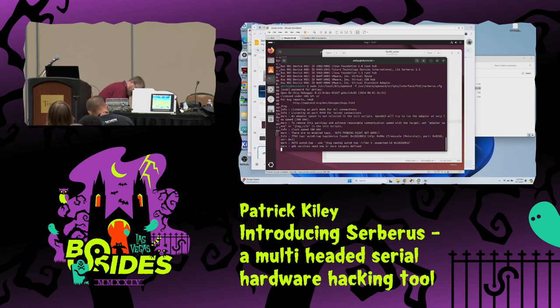And I'm going to grab this chip I dropped just so I don't forget it. This is the actual main CPU that drives the screen. It's an NVIDIA Tegra. It's an interesting target because it's the same processor that's run on the Nintendo Switch, subject to all the same vulnerabilities. And luckily, it has a little hidden USB connector that gives you U-Boot access as well. So have fun if you want to explore that. These aren't used in the current versions of the car they came from anymore. They've moved like two revisions past that, went to like Intel Atom, and now I think they're on an AMD Ryzen version of a CPU. But the NVIDIA Tegra has some hardware level vulnerabilities, so that's why they moved off of that. The gateway itself, though, that's a pretty juicy target if you ever want to start messing around with car hacking.